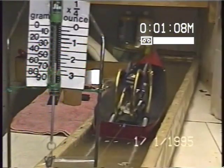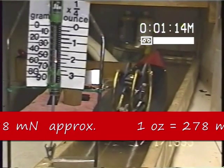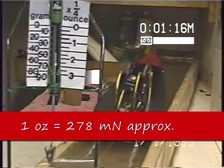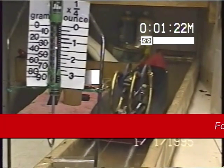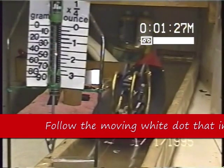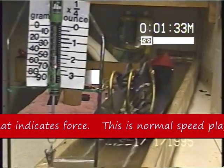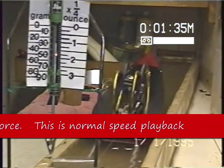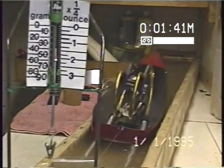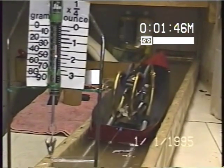Next up is a video of my most powerful engine running in the test tank. As you can see, the force in putt-putt engines varies quite a bit. After a warm-up period that can take one half hour or more in larger engines, the engine will mostly run plus or minus about 10 percent of its average normal force. About 5 to 15 percent of the time, it will run higher or lower than the average force. It can be difficult to determine the average force due to the variations, but playing the video back at two or three times normal speed will usually give a fairly clear picture.